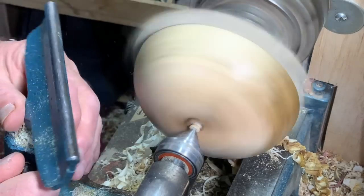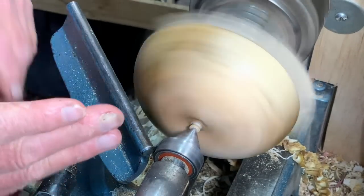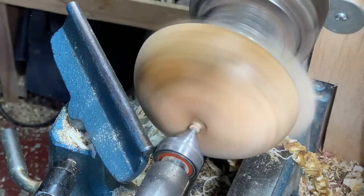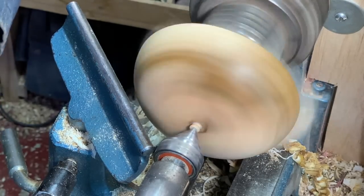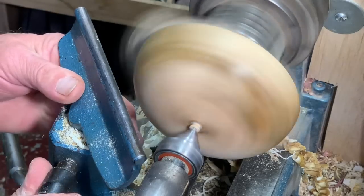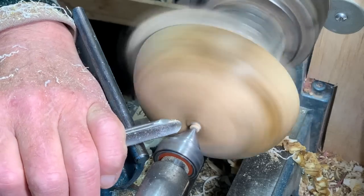This is cross grained, so that when I do the last little bit I can just shift the little push, just slides the grain, but in fact the tail centre is barely going round, which implies that that's well and truly held on the chuck, all jammed on. I'll take this off a little bit more.